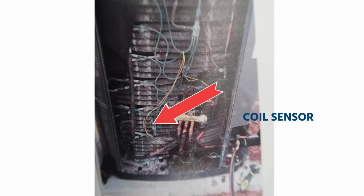Another fun thing I want to go over is checking the charge. So we went over the process on how to check the refrigerant charge in heating on the Carrier system. What's different about the Carrier versus the Trane equipment? Well, placement of the true suction port. You pull the side panel off of a Trane, and on the newer ones, the really, really old ones prior to like 1999, 2000, they have the charging ports on the outside in addition to the king valve ports.